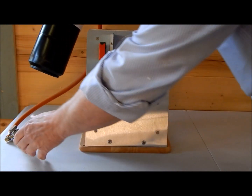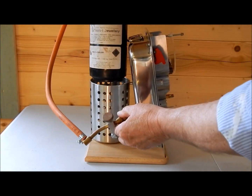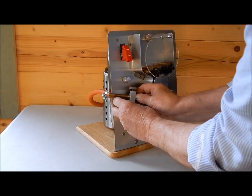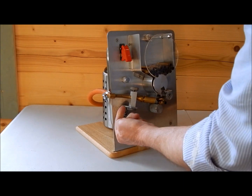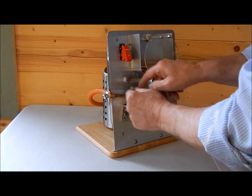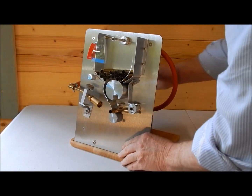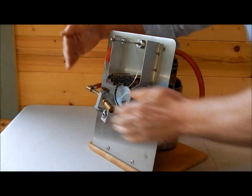We've got the burner system here and I'll supply this as it is. Stop straight in there if you've got the on/off valve there. The burner is adjustable for up and down, in and out, and round and round, and the burner flame length can be adjusted by this to slide the burner in and out a little. What we're looking for is for the burner to be aiming at the shoulder of the joint of the neck of the cartridge there and away from the metalwork. When we're on there it wants to be about like that so the flame is coming away at an angle.